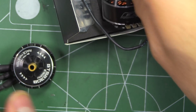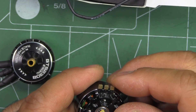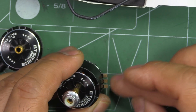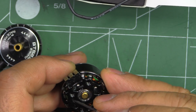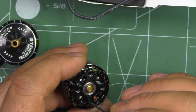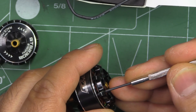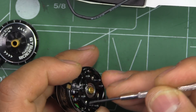The motor uses tabs — the wires are not attached. I kind of like this idea; it works pretty well and I haven't heard of anybody having issues with these. You just have to solder it right there. One advantage is they use the PCB where you solder the wires as a shield between where the mount screws go and the stator windings. So when mounting the motors, if your screws are too long you'll hit that PCB. Make sure you don't tighten it too much because you may end up cracking the PCB.